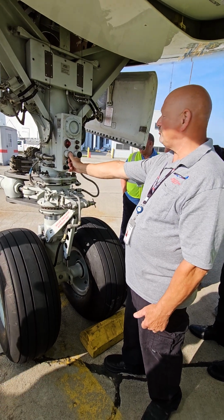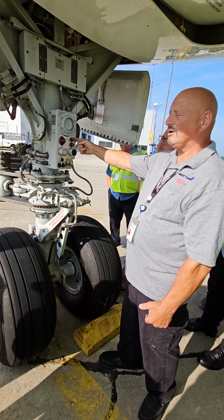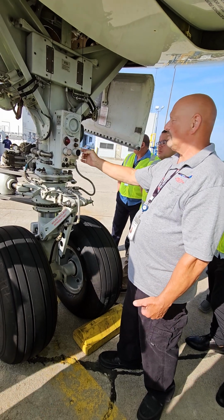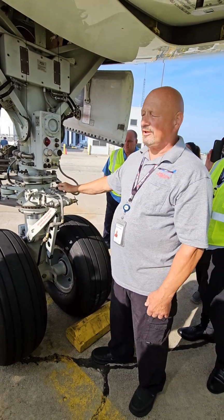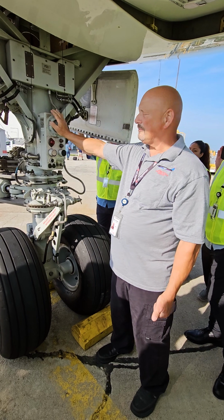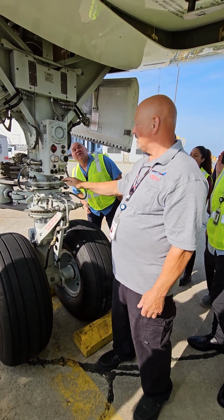So as soon as you or maintenance pushes that shutdown, this arm light comes on, and then I discharge the agent, and then the discharge light comes on. So you can shut it down and arm the bottle from here? Correct. But if the horn's going off for a fire, it's probably already shut down or shutting down. So you're just going to arm it at that point. Right. But I have to still hit shutdown to arm the bottle. Gotcha.